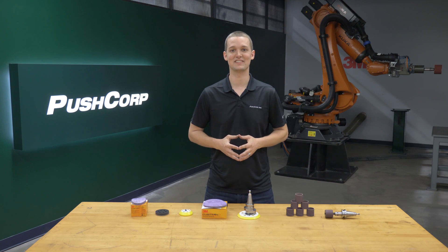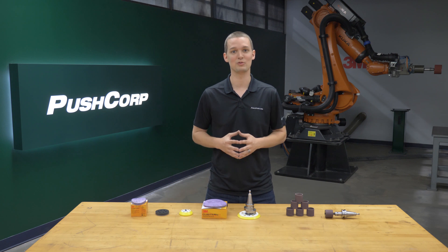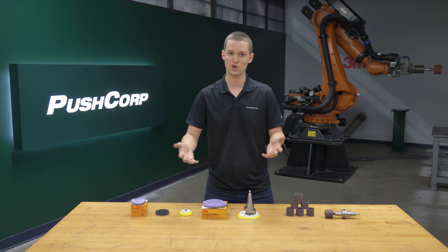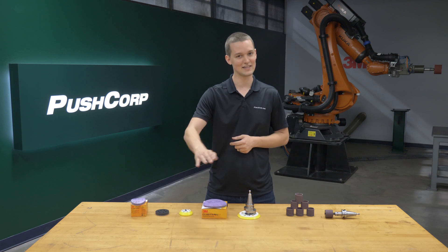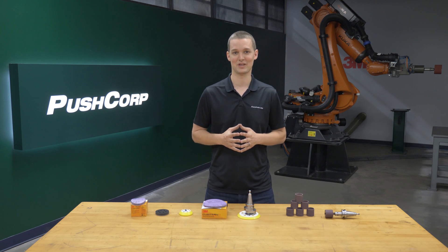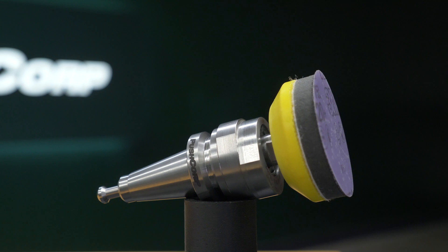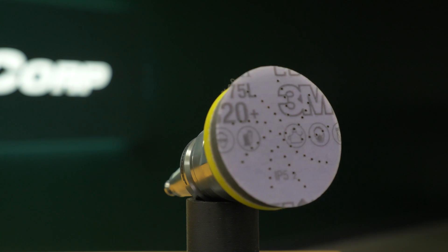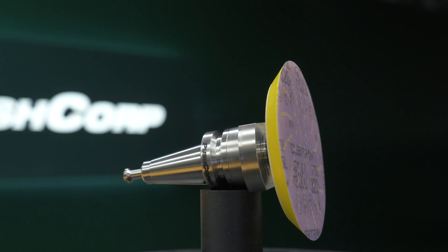Its small profile allowed access into the small inner diameters of the electric guitar body. The rest of the part was sanded using 3M's Cubitron II 775L film disc featuring 3M's precision shaped ceramic grain. It's designed to slice through the substrate giving a faster and longer lasting cut — a great pairing for robotic applications. We paired the disc with 3M's 5-inch and 3-inch backup pads using an interface pad in contoured areas. These package nicely onto PushCorp's BT30 random orbital tool holders.